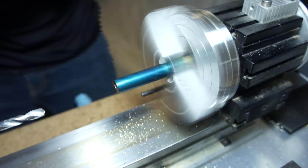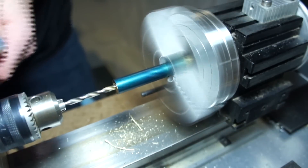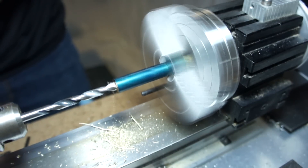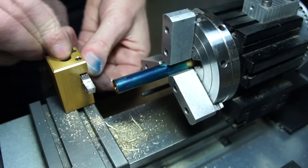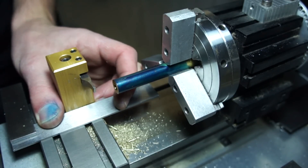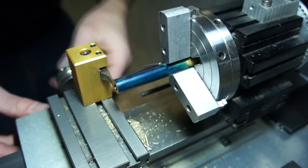You can also see my blue thumb from the spray-on bluing stuff — which is not the way I should be using it; I should definitely get the brush-on stuff. I switched to a smaller drill just to clear the hole in the center for the pilot, since I was trying to drill with too big a drill. Once again this is pretty non-critical work; I'm just sizing drill bits by eye to make sure they'll clear all the axle diameters I need. Here I'll be using the parting tool to make all the washers. I use my little machinist square to square out the parting tool so that I'll be cutting flush on both sides. And here I set my calipers to about 30 thousandths of an inch just to give me some little brass washers.